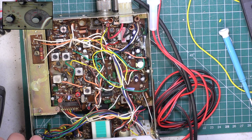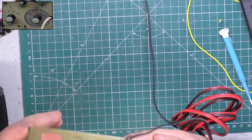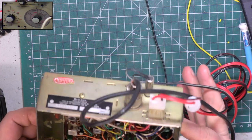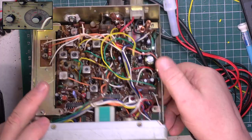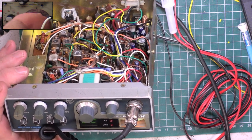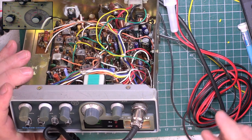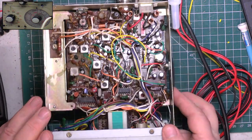So let's get that S9. I think it's preset on these, and it is spot on. It's S8, isn't it? But is it not adjustable on these? And there have been occasions that I've popped an extra preset in just to alleviate any concerns. But it's so near. So it's saying S8, so how much signal does it need to get S9? It's 150 microvolts for S9. But it is manufactured like this, it isn't faulty. And I say, if it was way out, I'd ask the customer if he wants it modifying, but it isn't way out, so I'm not going to ask the customer if he wants it modifying. Some production of various Maxcoms with this chassis did actually put a preset in.